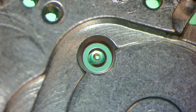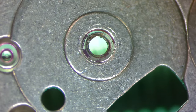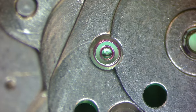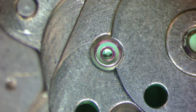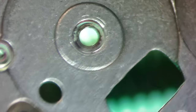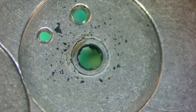Checking the jewels before cleaning: the third wheel jewel and center wheel jewel just look like old gummed-up lubricant — not over-lubricated, just gummed up. That escape wheel looks dry as a bone — it's clean. The pallet fork looks perfect, almost like it's already been cleaned. Here's that lower barrel arbor port: you can see gummed-up black lubricant turned into a paste, and you can see where it's been rubbing on the plate in that bushing.